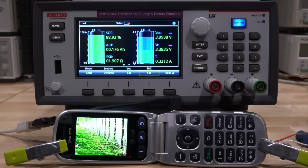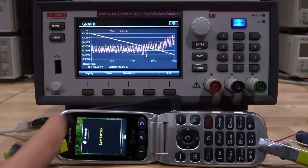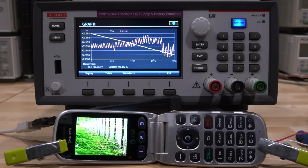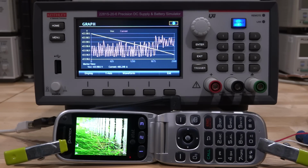And you get all the benefits of the plotting functions that it comes with. So if you go on to the actual plot functions of the battery here, you can plot the different behavior of how much current is being taken, what the state of the charge of the battery is, how it's discharging, how much capacity is being used. Pretty useful to have a good digitizer on top of the battery emulator, and you can gather that data, take it out, plot it, analyze it, and so on. And there you have it.